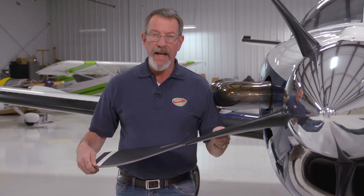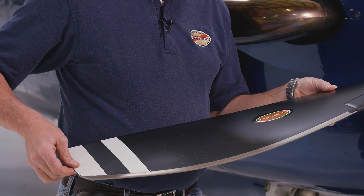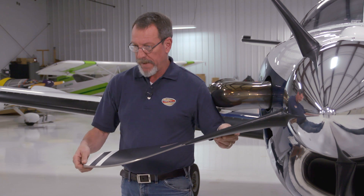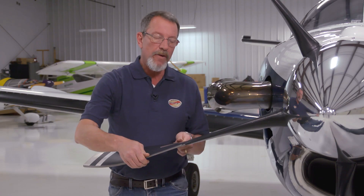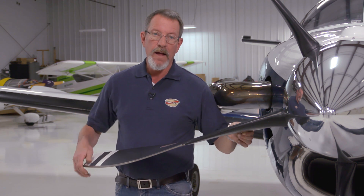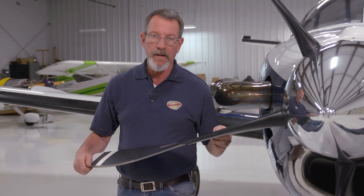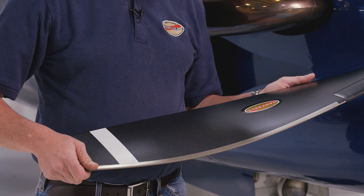Next, you'll want to check the blades for blade play: check for radial play, end play or up-and-down movement, and in-and-out movement — pulling the blade back and forward — and fore-and-aft movement. You may get a little bit of radial play; you're allowed a half degree plus or minus. Up-and-down movement — the blade should be tight, but if it moves and returns to its original position, that's acceptable. For in-and-out movement, trying to pull the blade out of the hub, there should be no movement whatsoever. For fore-and-aft movement, you may get some slight movement, as long as the blade returns to its original position, that's acceptable.